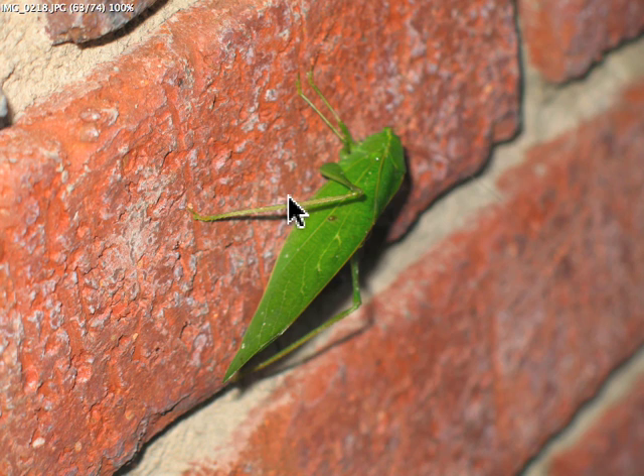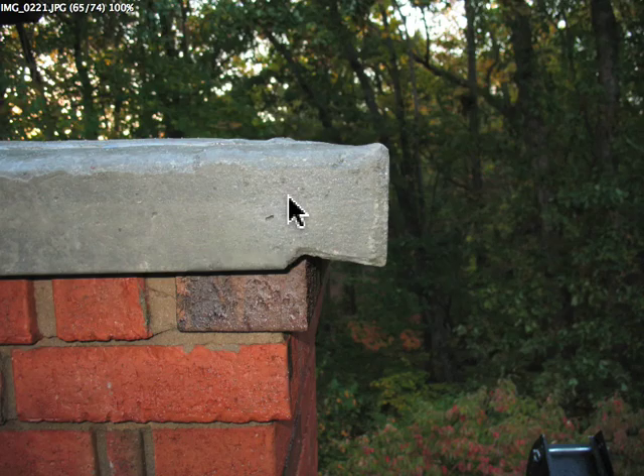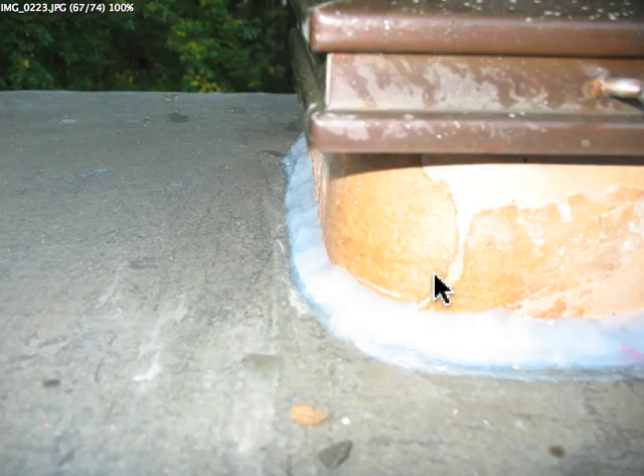There's a little thing Katie did — I thought it was a leaf, but it was a little bug on the chimney. Got your cap back on. We did something new with our corners — our forms where they fit together had a little gap, so we used putty sealant to seal the gap so stuff doesn't run through it. A much cleaner corner on the floors — first time we've done that and it turned out pretty nice. The expansion joint around the flue tile gets filled in with silicone so water doesn't get down it. Really good seal — about 50 years is what they say.